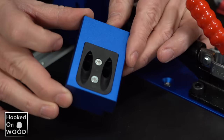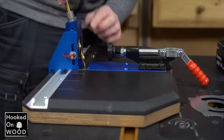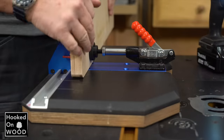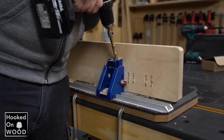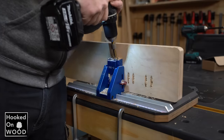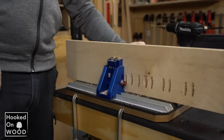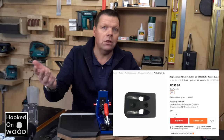When we set up the jig, we can drill some holes. They claim that this upgraded version with the black piece in the middle will give a superior hole without tear-outs. When I made my first holes in plywood, it became a little bit better after the first two holes, but I did not see a significant difference over the Yomo or other pocket hole jigs I have. I tested it on different kinds of wood and there is some tear-out, but when you clean it a bit it leaves a very nice hole. One advantage is that you can buy these inserts separately, so you can replace one if it wears out.